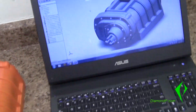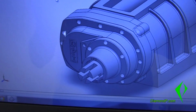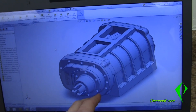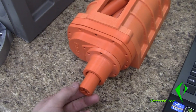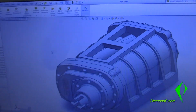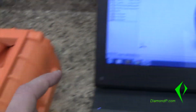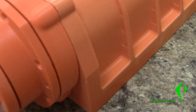The housing was done a bit differently. Here is the 8th scale, and you can see a few design changes. One of the most noticeable is the coupling out of the snout — this one is internal as a cross, and this one is actually cut out. I did this because when fully printed it will only be 6 inches long from the snout to the rear plate, so I was afraid it would be too weak, and you also get detail problems when printing stuff that small. The rotors will be 60-degree helix. Also, the top face does not extend to the plate as it does on the half scale, and the 8th scale will be cut completely out and around into the bottom too, to fit perfectly with the bearing plates.